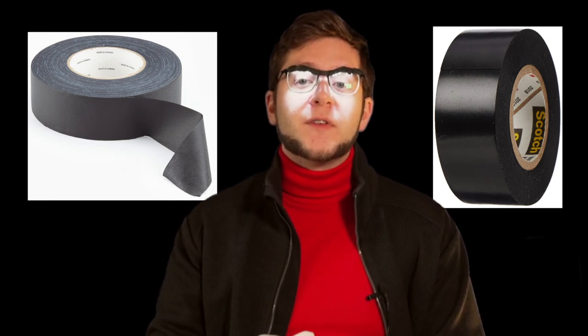Tape is not required for safety — you will not hurt yourself if you touch the positive and negative sides of a nine-volt battery at once. But it will help prevent exposed wires from touching, which would cause a short and make your LEDs stop working. I actually recommend gaff tape over electrical tape because we're taping our glasses and electrical tape leaves a lot of goopy black residue. The tape does two things: it stops leads from touching each other causing a short, and it stops LED leads from scratching your glasses. I scratched the blue light filter on mine the first time — get some tape that matches the color of your glasses.